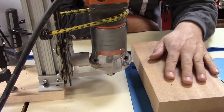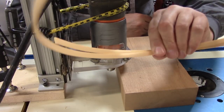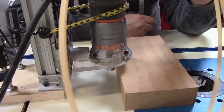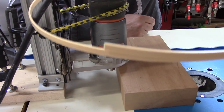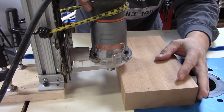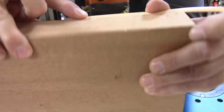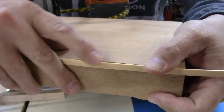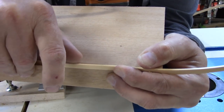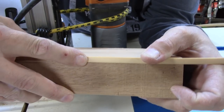It's always a good idea to use a scrap piece of lumber and test the depth of cut to make sure you have the right depth for the binding you're using. I'm going to use this scrap piece of mahogany here and make a few test passes to make sure the binding — in this case it's a quarter inch thick — we want to make sure we have as much binding showing as possible, so we're going to make the cut about a quarter of an inch deep. As you can see, my binding looks pretty good — our bit is adjusted properly. The binding is just a little bit proud right here, just barely enough to get my fingernail on top of it, which is ideal. I've got the right size bearing because my binding fits nice and flush there. We are ready to do this body.